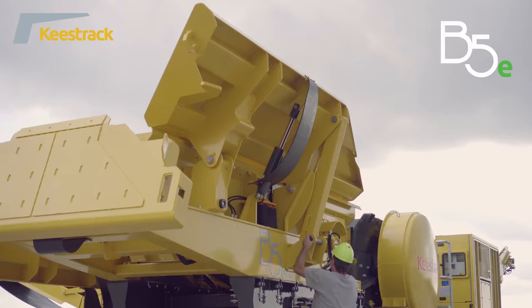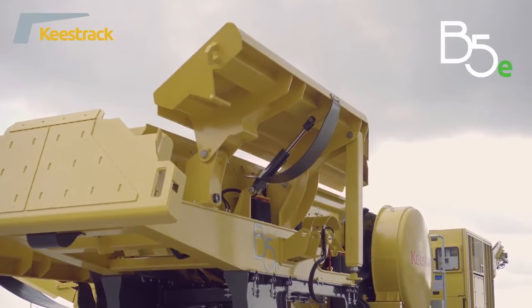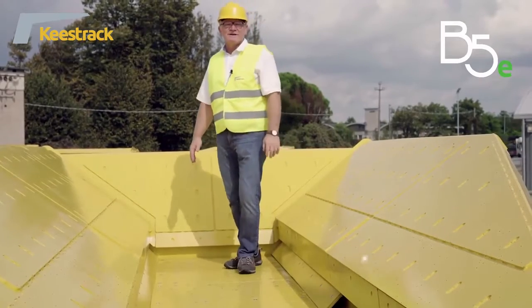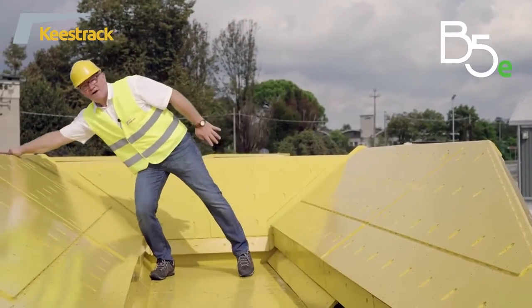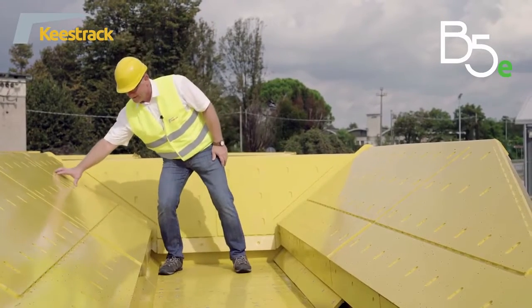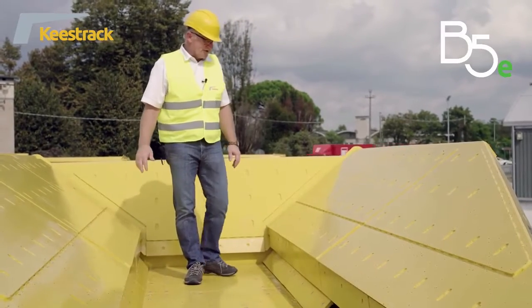To give lateral support to the hopper walls, we have here extremely heavy duty beams which support the hopper against bending. And for transport, it's very simple. You just remove the bolt and nothing more. So the hopper itself has a feeding width on the rear side of 3 meters. It has a feeding length here on each side of 2.8 meters and a feeding height of 4 meters. Inside the hopper is lined with hardness Brinell lining 450, 10 millimeters and 15 millimeters for heavy duty quarry applications.